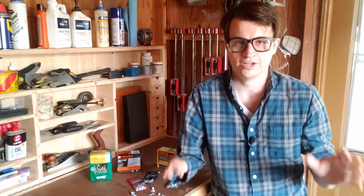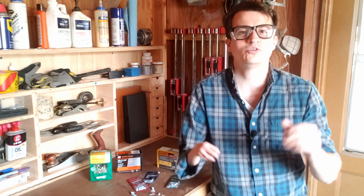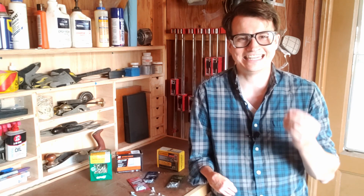When you go to the screw aisle, they're all arranged by type. First ask yourself what type of material am I fastening together? Is the hole already tapped? Then you want a machine screw. Attaching thin metal? Sheet metal screws. Wood to wood inside? Wood screws. Wood to wood outside? Deck screws. Hanging drywall — and only for that — drywall screws. Anything to anything, go with a multi-purpose. Next, determine the gauge. Most of the time a number 8 will work. If it needs to hold more weight go with a 10 or higher; if small and intricate go with a 6 or smaller. For machine screws it needs to be an exact match, so consider taking your receiving part to the hardware store to test it and find an exact match for the gauge and threads per inch.